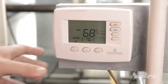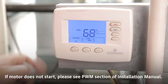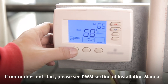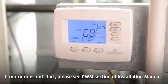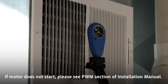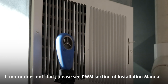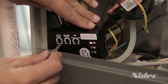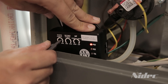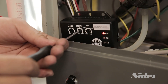With the system power still on, adjust the thermostat to ensure there is a call for heat or cool. Remember to give the system time for any startup delays. Now repeat this process for the other setting. Fine-tune the speed for both heating and cooling modes by verifying the CFM and temperature deltas meet the original OEM's requirements. Adjustments can be made using the EZI box, using the Y1 and Y2 dial for cooling mode and W1, W2 for heating mode.